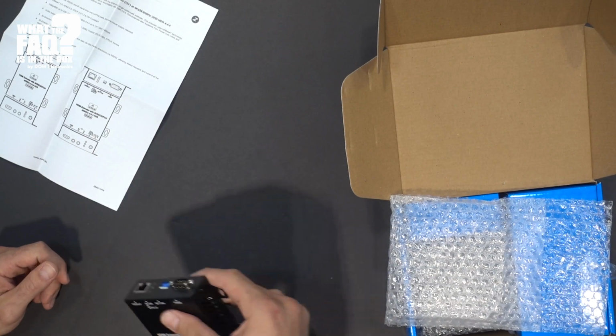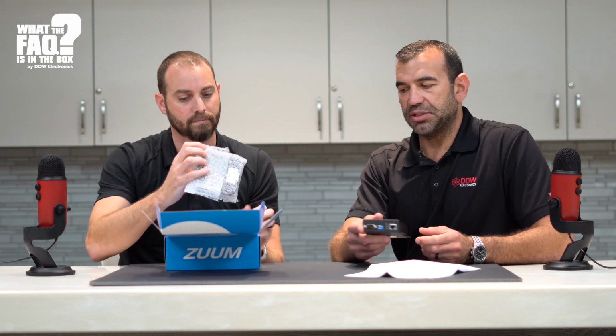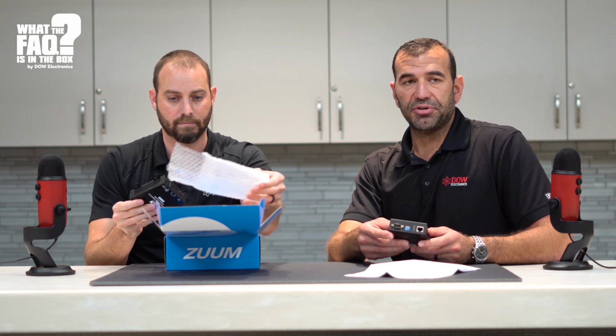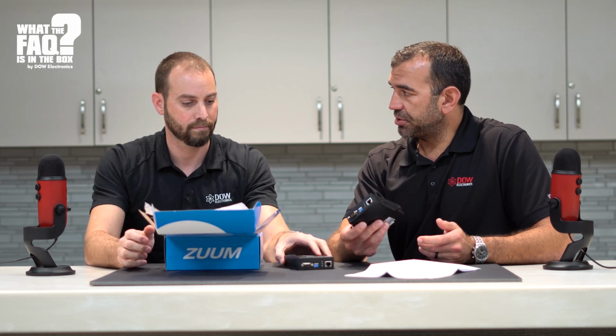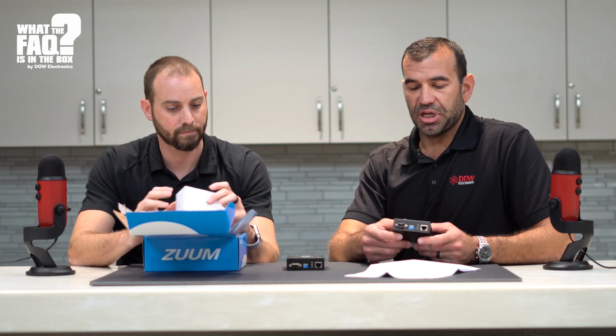We've got a receiver, right? So the box does come complete, you've got the complete kit. As Drew's breaking it out, you're going to see that we've got the power in the box. We have the transmitter and receiver. This is a single Cat 5, Cat 6 unit, so it only needs one Cat 5 or one Cat 6, and it's also PoE, so you're going to see that there's actually only one power cable in here that you can set up on one side.